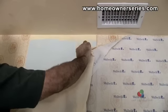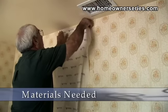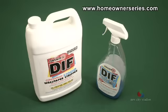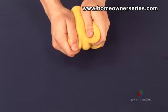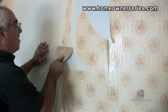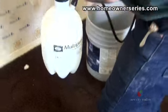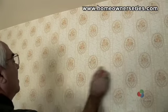To remove wallpaper, a few materials and tools will be needed. The materials needed are wallpaper cloth sheeting, chemical wallpaper stripper, a cleaning sponge, and warm water. The tools needed are a short ladder, a bucket, a 6-inch taping knife, a hand tank sprayer filled with wallpaper stripper, and a circular wallpaper scorer.